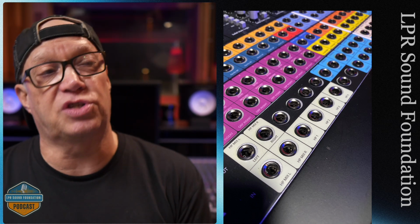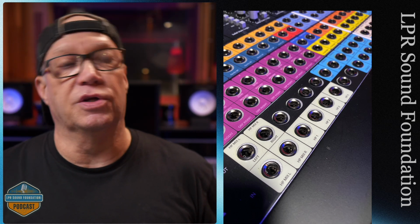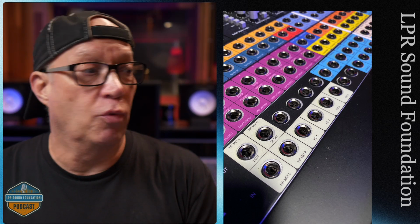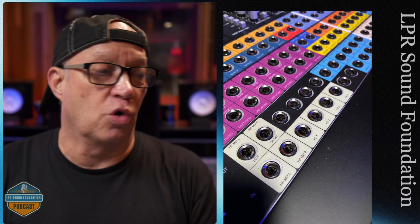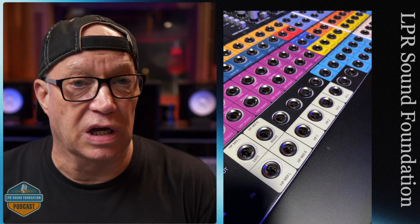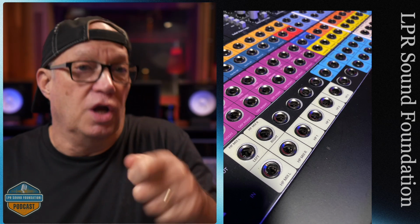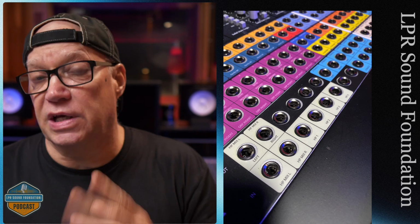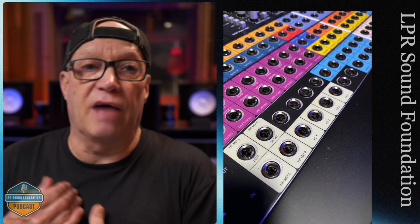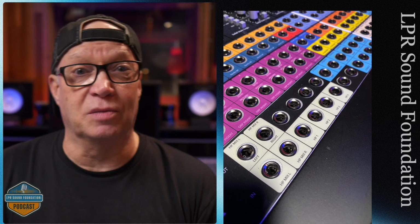Now, sometimes we want to separate out, say, the vocals. We want to give them a knob that they can control the vocals, or we want to give them a knob that they control just the music, or just the click. Say we're sending a metronome to the drummer. The drummer can adjust how much click he has in his headphone. I don't have to worry about it. If he feels like he needs a little more, he can reach over and turn it up with this system. And this system's really simple.